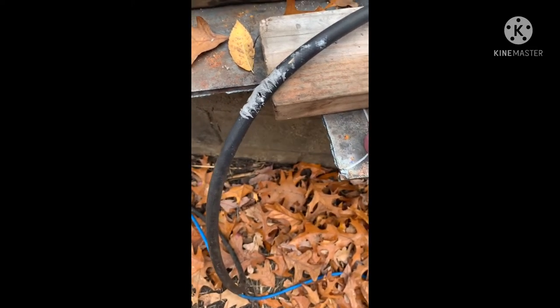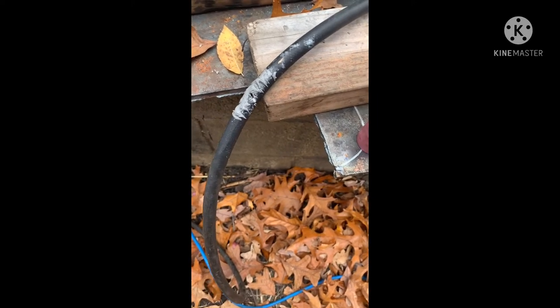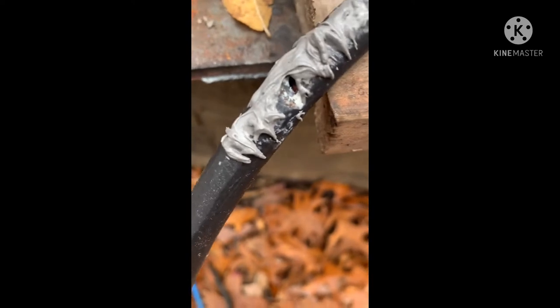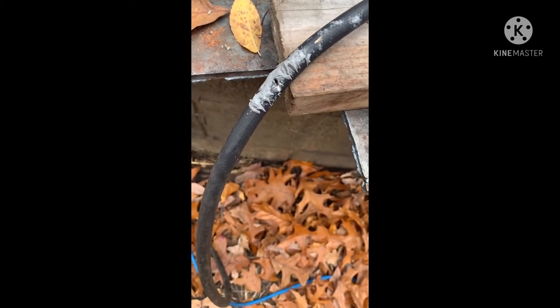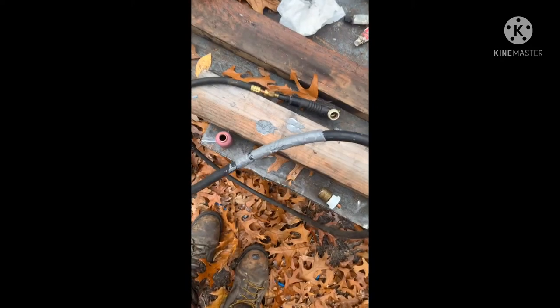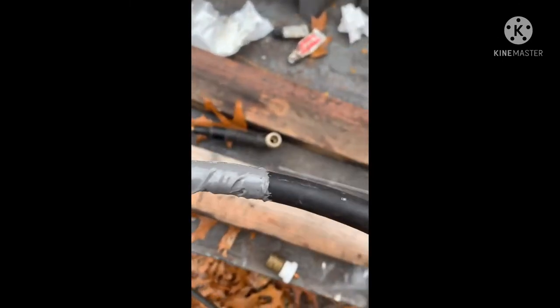I went to sharpen the tungsten and ended up feeding my hose into my foot grinder, so I got a hole in my hose. So I just acetoned it down, slapped a little JB Weld on it and let that set. I got that all on there — definitely want to get it all the way around on each end so that when I put my rubber hose over it to cap it, it'll have a seal.